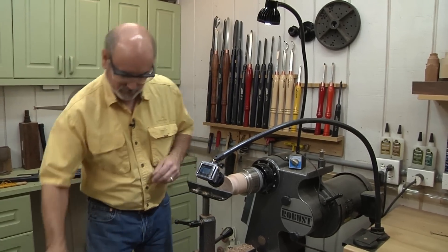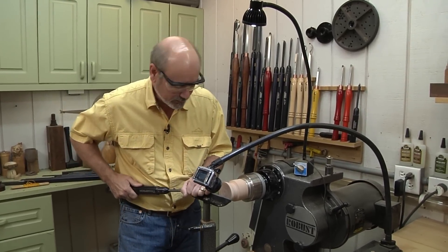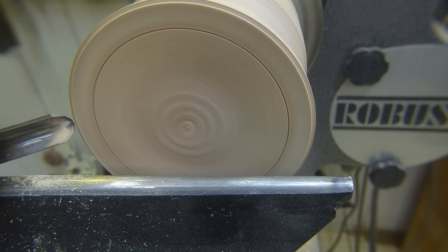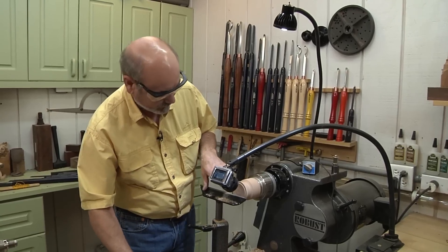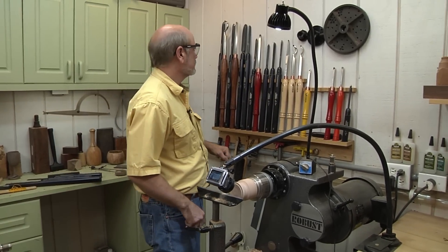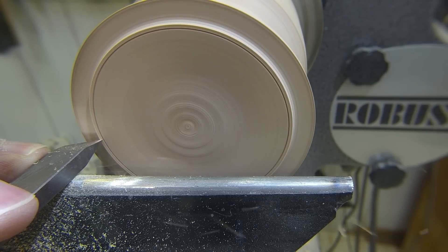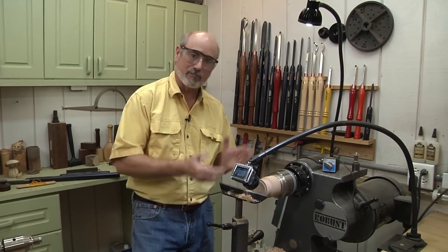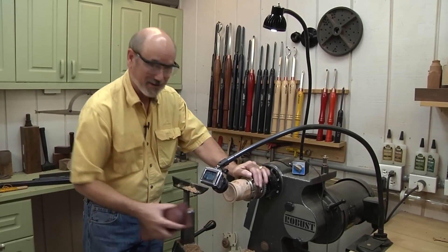I'm using my whole hand as a brake right here to bring this in. I'm going to use the spindle gouge and go in straight, then rotate it once it starts cutting. I'm sneaking up on that mark — I don't want to get right to that mark. Then I'm going to grab my skew and do a push straight in. There we go — we made a lip. The only reason I've taken off a little bit of wood is so if I screw up, I've got more wood to play with. Let's slide this out of the way, bring this up here, and see if it fits. I'm not kidding — I hit it on the first try. That never happens.